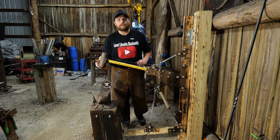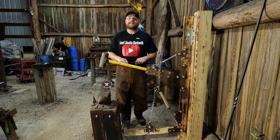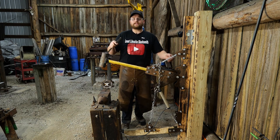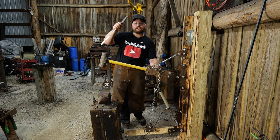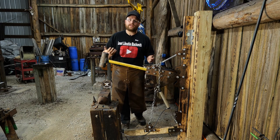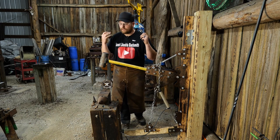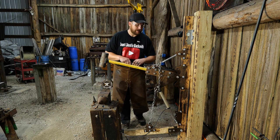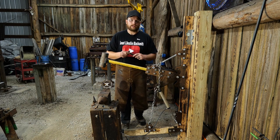About 12 inches of throw - it's hitting very hard. The reason I say that's adjustable is I can take a few more links out of this, I could raise it up higher or lower it down, and that'll change the pitch and the hitting angle of the hammer. All of that is adjustable and tweakable. If you feel like it's hitting kind of weak, you may want to go over those things and check them out.